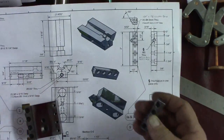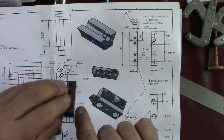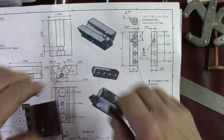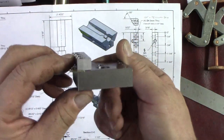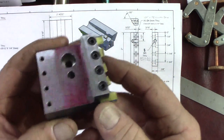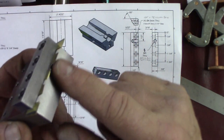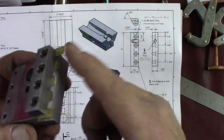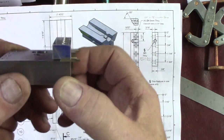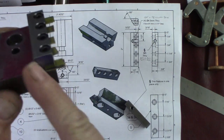Last part, we were working on these — these are the dovetail pieces. We're going to mount them in the dovetail and cut off the corner at 60 degrees. We'll do one at a time, just like the instructions suggest. We've got one mounted, and I have 20 thousandths worth of shim underneath it between the screws and on the end, so it's very solid. We've got a 20 thousandths gap underneath here and we're going to take off this corner.